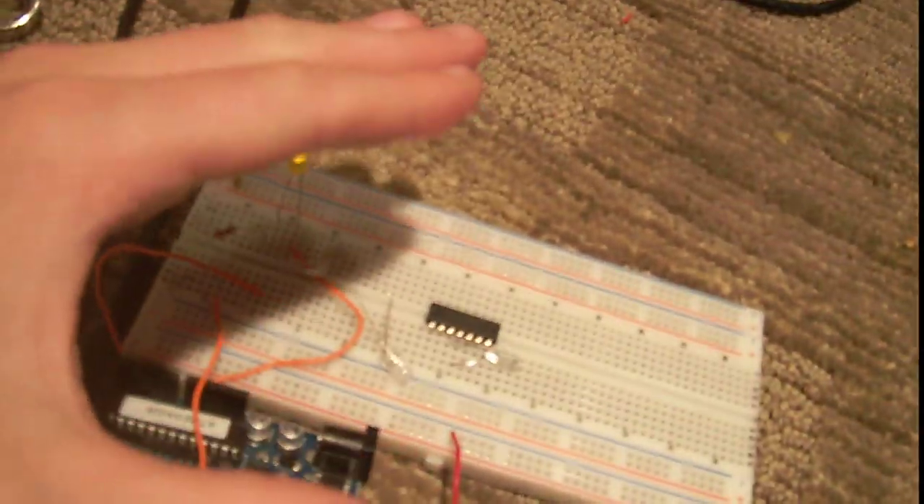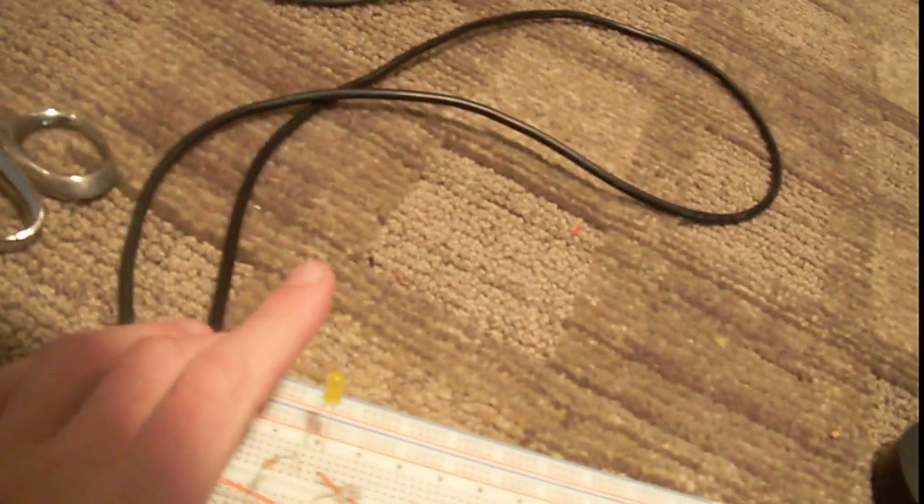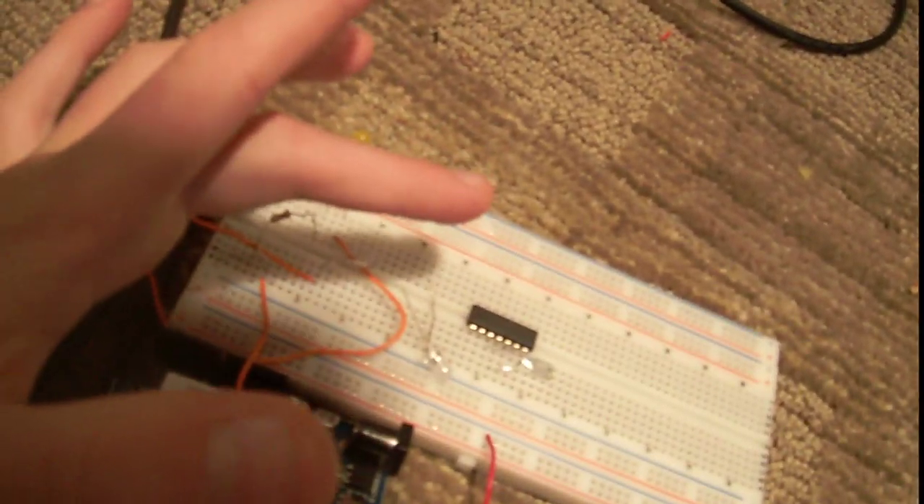So anyway, that's just my simple circuit. Hope that helps you guys. As you can see, it does work really well. So if you ever need a light sensor, don't use a CDS cell — just use any LED you have lying around. But keep in mind, every LED will have its own unique number, so yours won't always be 129. For instance, this yellow LED is in the 300s in light, and this one is at 144 in light. It does work very well, and the code will be on the website for those of you who want to use it.